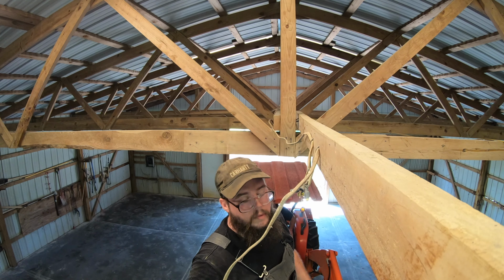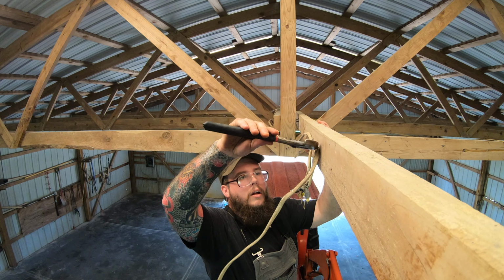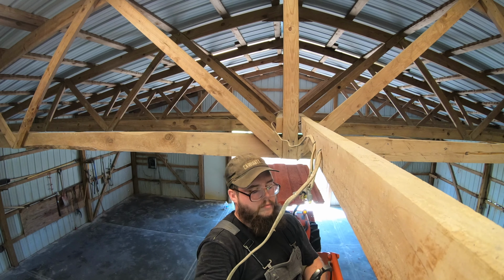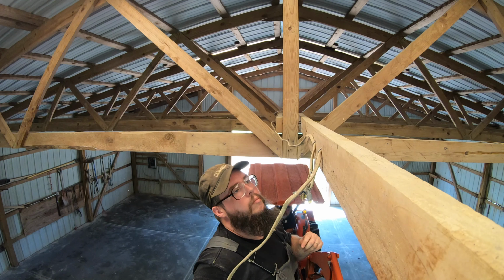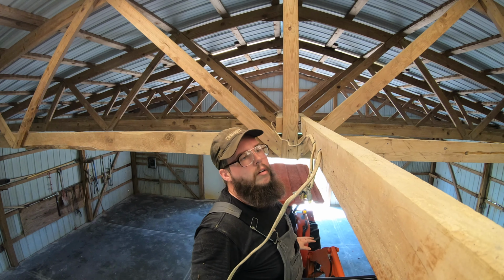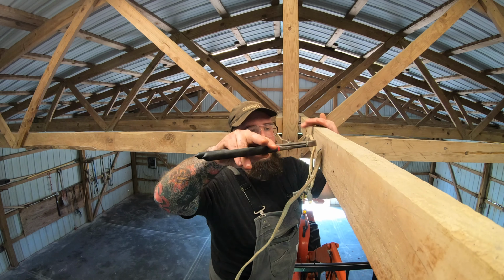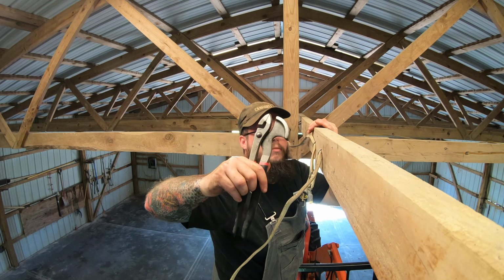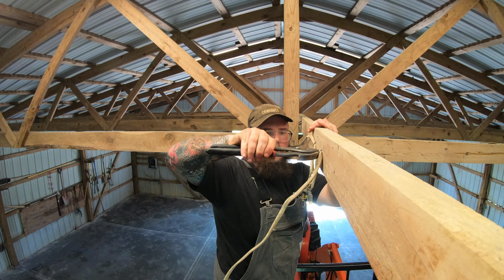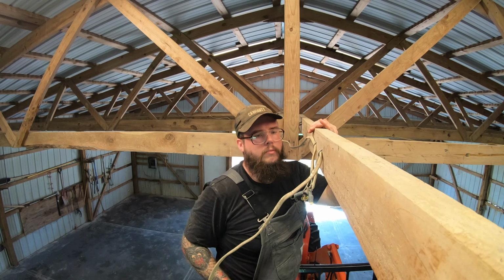We would just have to pressure wash everything and clean it out and make sure that all the dust from cutting those expansion joints is out. We'll be filling the expansion joints with twine, and then this sealer polymer type material. It's kind of like caulking, so if you know what caulking is, you use a caulk gun, and that's what we're going to be doing.